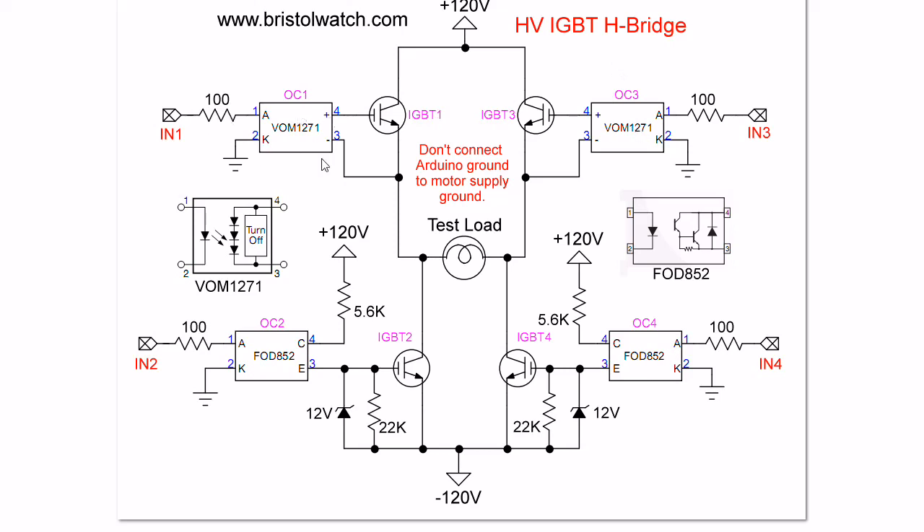Here's how you do it: turn this one on, then pulse width modulation through this one. One is on, N1 goes high, then you can pulse width modulate through N4 — make sure the other two are turned off, as you see there.